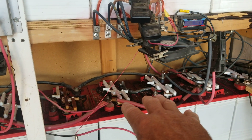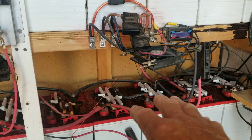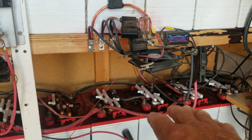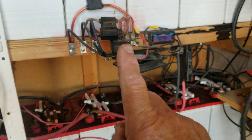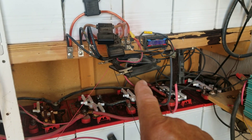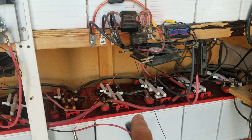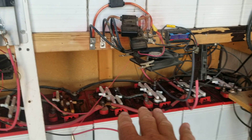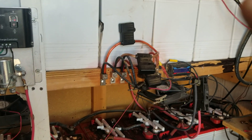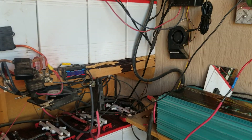That's like two 20-amp breakers for one hour and those batteries are dead. Remember, if they're lead-acid wet-type batteries, you can only use 50% of the battery — so now you're down to 20 amps for one hour. That means you could have a freezer on a 20-amp breaker and run it for one hour on those batteries, and you're already at your kill point.